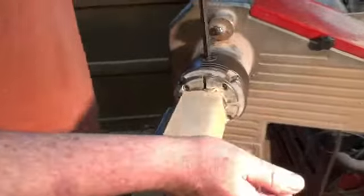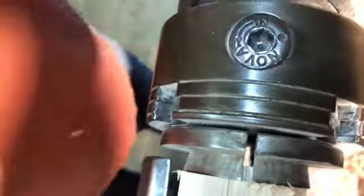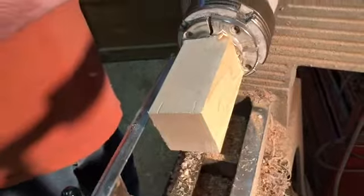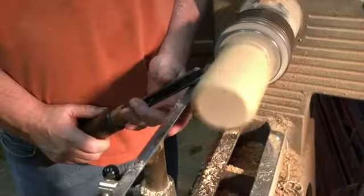It's important — you get this from over the top — that your jaws are almost closed and that your tenon doesn't bottom out in the jaws. That tenon's maybe a quarter of an inch, but grab it this way and it's really secure. Because I don't turn with a tailstock when I'm making it, I want that to be gripped.